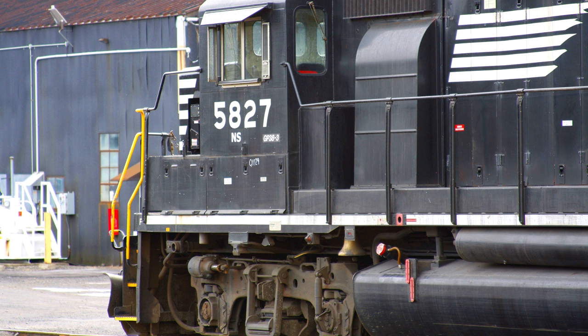The cab was built to the general design and dimensions of the EMD standard cab with a flat panel under the headlight as on earlier EMD units and a welded rectangular side panel as on late -2 and later units. The subbase and battery box doors, the notch for the handbrake, and a few other minor details differed from the EMD-built versions. During the cab conversion, the units were changed from long hood forward to short hood forward operation.